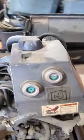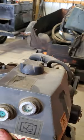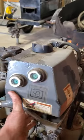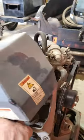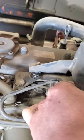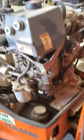I'm getting ready to service this thing and doing my walk-around inspection. I noticed — I don't know how long it's been like this, the operator probably ignored it — but the bolts that hold the coolant reservoir sheared off, all three of them, because they're not grade 8. This is a pretty critical component. You can see they have a rubber bushing. All three of them sheared, and this machine has less than 1500 hours on it.